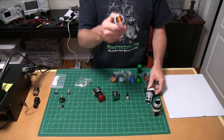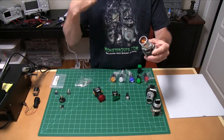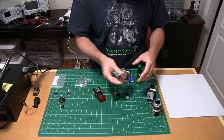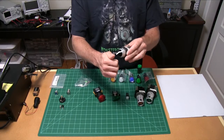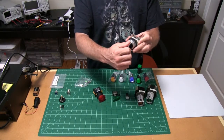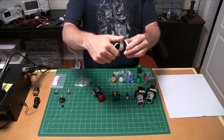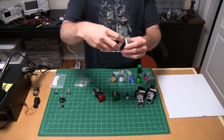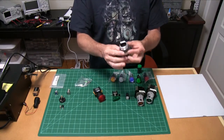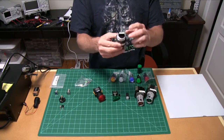I've got a couple of these, including a yellow one. These are all momentary switches, meaning when you push the button it doesn't stay clicked, so you have to think about that when building your control panel and deciding what each switch will do. Then there are actual switches here — this is a two-stage switch where the center is usually off and you can control one thing with one side and something else with the other. These little escutcheons or collars unscrew; some needed replacement parts. Those are easy to find but not cheap, so it's best to find an eBay auction that's about to end and bid on one.